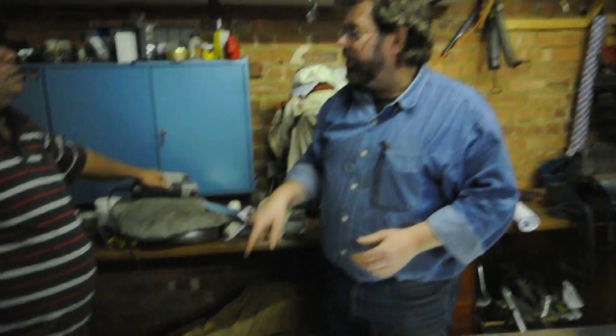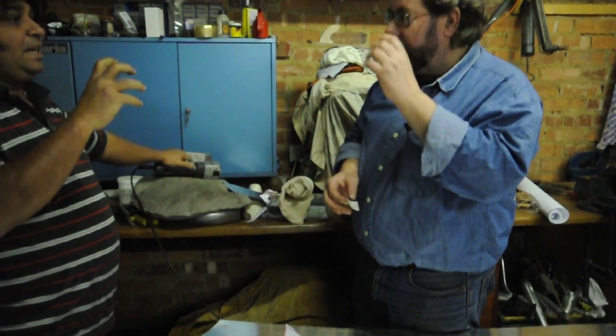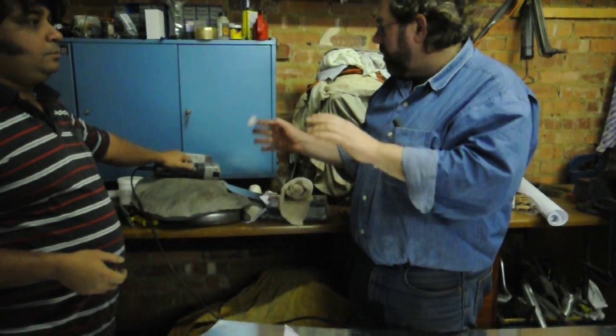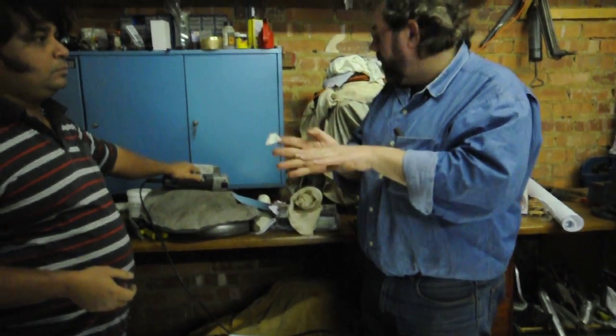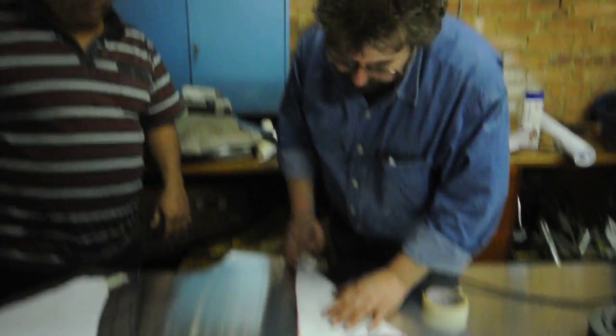This is thicker and it's aluminium, and it drags a bit. Yeah, because it's sticky-like. It's slightly thicker and the jaws are basically set up for steel to aluminium — you have to really adjust them slightly different. If I set that for aluminium, it won't cut steel. So it's like a halfway house, as it were.